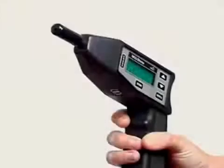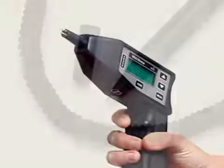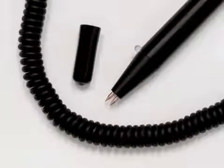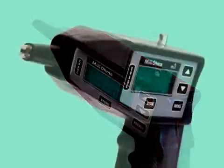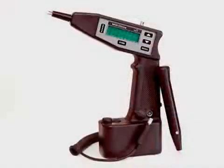The meter is a versatile handheld instrument. Removing the protective cap exposes its probe tips. A plastic cap also protects the tips of the M1 standard remote probe. Maintaining the condition of these tips is essential for the meter to function effectively. The M1 milliohm meter makes readings by measuring the electrical resistance between probe tips. The meter will not display a reading unless the proper electrical continuity is established. You will either get an accurate reading or no reading at all.